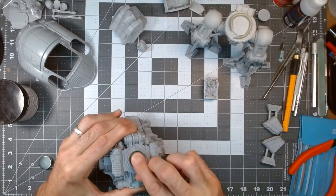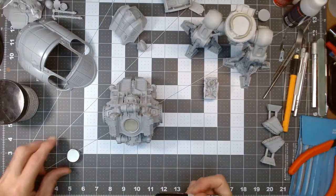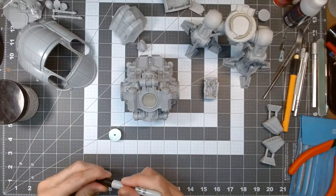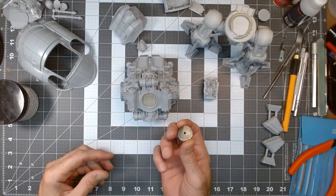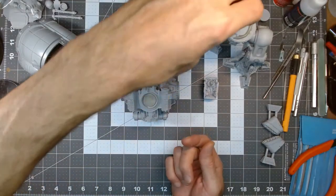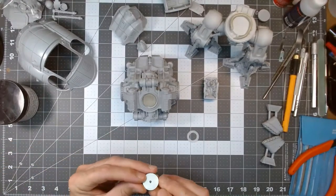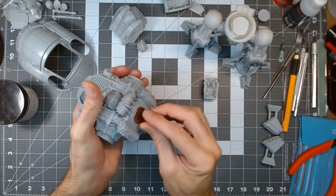Then this, we're just going to stuff down in. And I'm at least minimally hopeful. I think I need to work with these magnets individually. So what I would like to do is take my Sharpie and put a mark on both outsides, right? That way, once I get to the point of putting the magnets in, I can separate these two. As long as I hide my Sharpie mark, they'll be polarized correctly. So the Sharpie mark goes away there, and there. Everything's happy. So I can separate these guys, and that ring in the middle really helps. With either of them, I just take the Sharpie mark and I can just force it in.